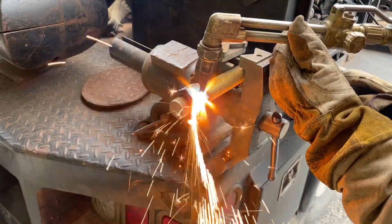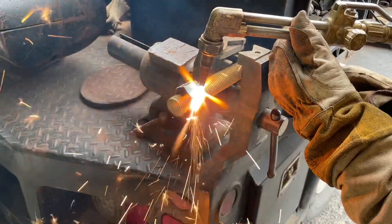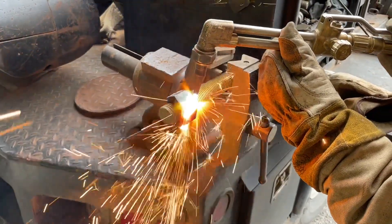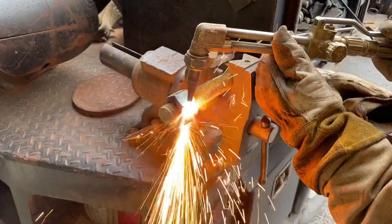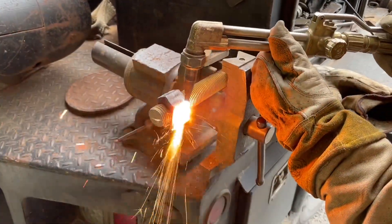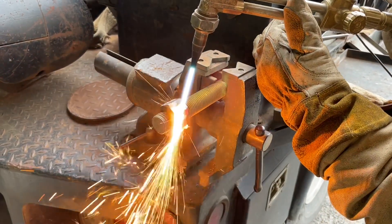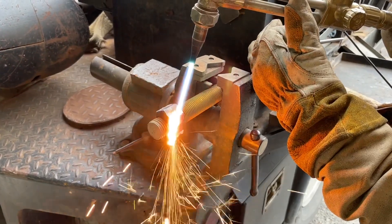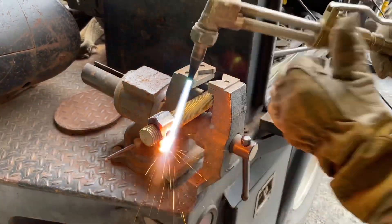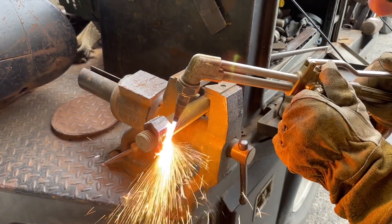I'm cutting a little bit, then stepping back and pausing just a split second. Cut a little bit, kind of make a loop, and step back. That's because my tip's too small, but sometimes you run into that issue where you don't have the right size tip — you can make it work in a pinch. Now I'm just washing it off, doing whatever it takes to get rid of it. When it gets hot I'm coming way off of it — that allows the oxygen to fan out and not be so pointed, because if you get close and hit the trigger you're going to knock a chunk out of that bolt, and then it's over.